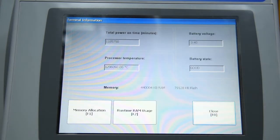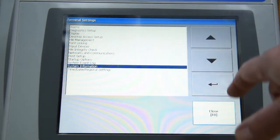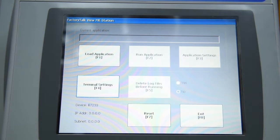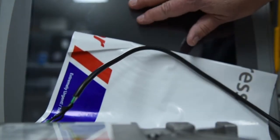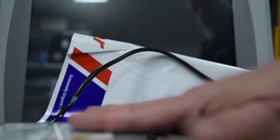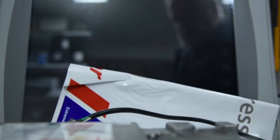Go to terminal information. It says battery's good, power on, lots of RAM. Close, close. See, it's working — just this RP-8 on the older PanelView Plus 1000 screen works just fine. Now, what I'm going to do is stop the camera for a minute. I'm going to swap the RP-8 onto the 1500 and the RP-1 onto the 1000. And we'll go through the same steps again and show you the difference that happens there.